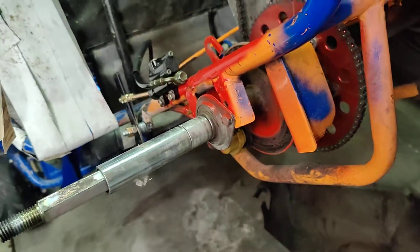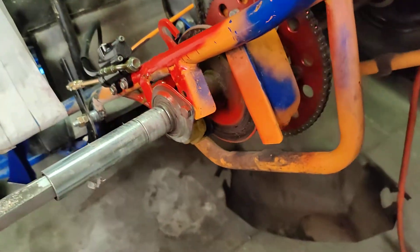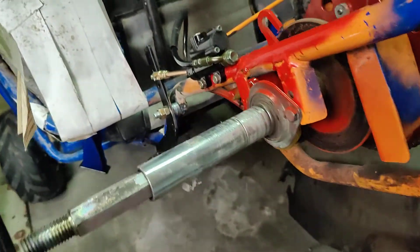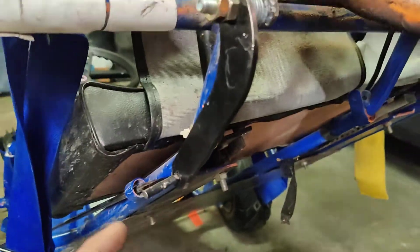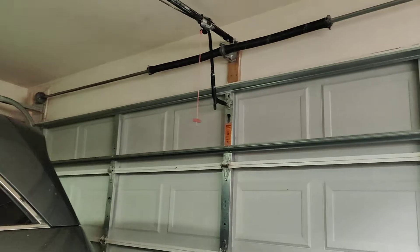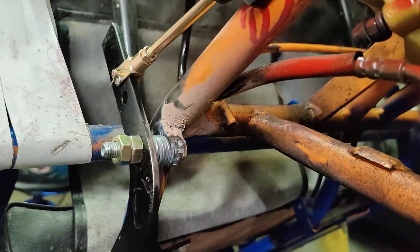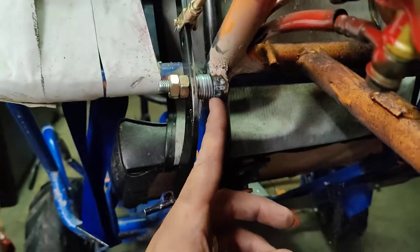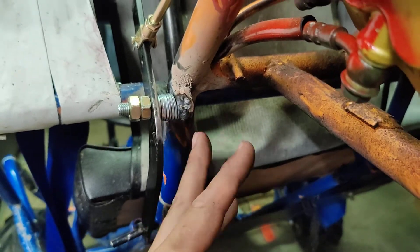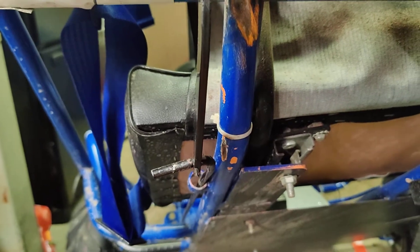The only thing I had to modify was the bar. There's a bar that connects from the brake pedal all the way up to the brake pad back here, and I cut it in a spot that made sense. I used what was left of a garage door lever — at the bottom of a garage door there's like a hook. I had an extra one; it's pretty thick steel. I went ahead and welded a bolt right here, then put a few washers and spacers to push it out so it wouldn't rub on this bar.